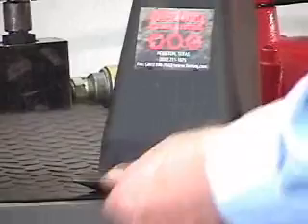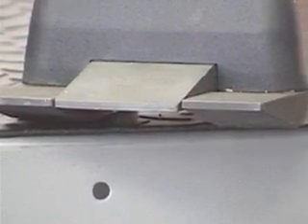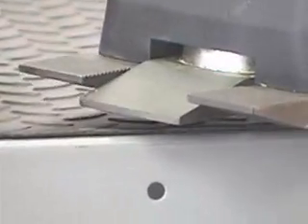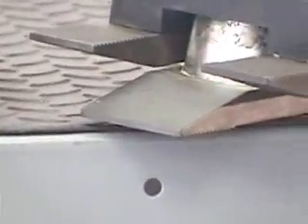It will open to three inches of travel and deliver 10,000 pounds of lifting and separating force. You'll notice on the front of the jaws of this flange spreader — and that's true of both the mechanical and hydraulic units — that it only requires three thirty-seconds of an inch gap in order to insert the spreader jaws between the flange halves. When we then begin to operate the ratchet handle, the mechanical flange spreader opens the jaws to a full three inches, as you see being demonstrated here.